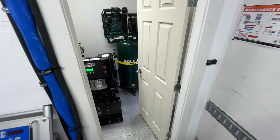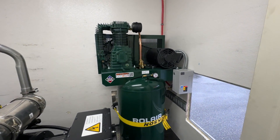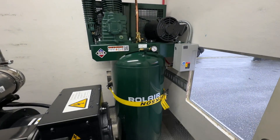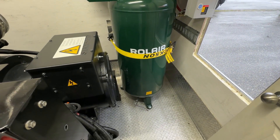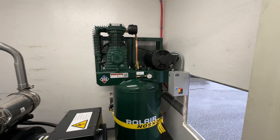Finally, we head to the back room where we find our air compressor, supplying pressurized air through the air dryer to the relevant components. Notably, the transfer pumps are air driven and the airline that runs throughout the hose propels chemical from the gun to its final destination.